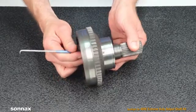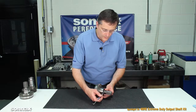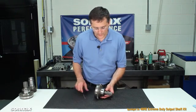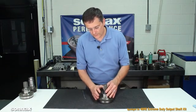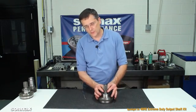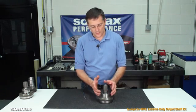The reason for that is there's a bore that goes back here for the bushing — it actually comes back into this portion, making it hollow. That thin cross-section of steel where it's hollow is where they like to snap off and break. Even if you were to upgrade the steel material, you'd still be stuck with that design limitation of the hollow portion and thin cross-section, and they'd still break off.